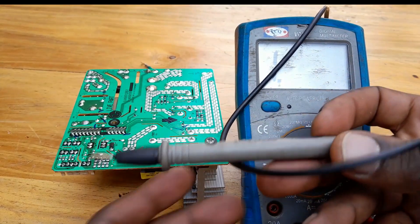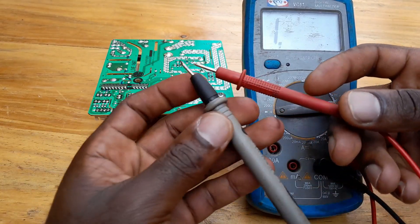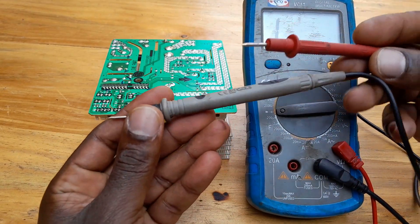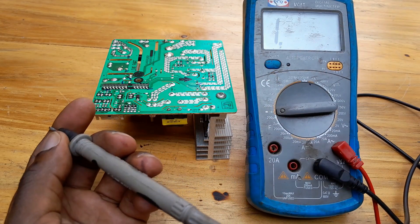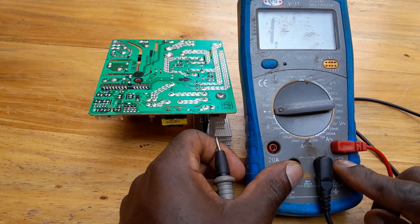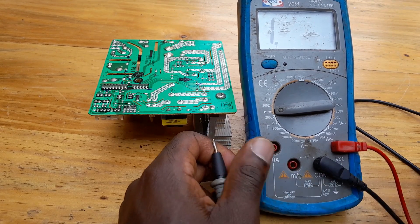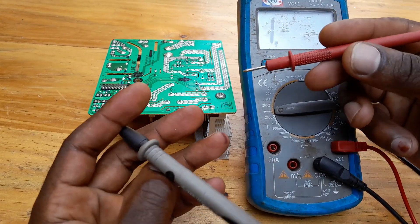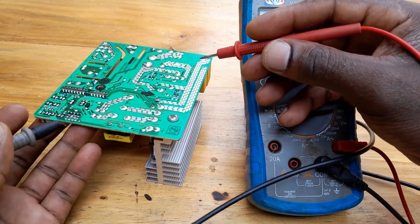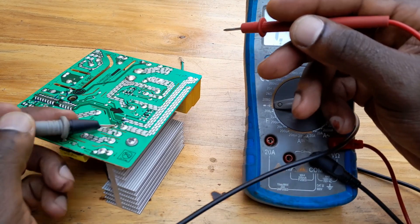You can see this is a plug. We have two plugs — positive and negative. This black one is negative, this red one is positive. This is for voltage and resistor, and this is common. So to measure this bridge rectifier, the negative probe has to be here in the middle, at the input of AC current.